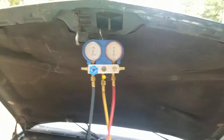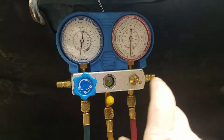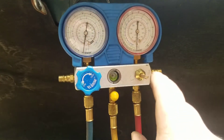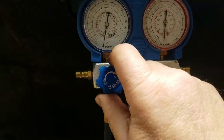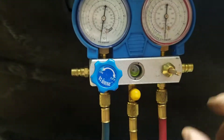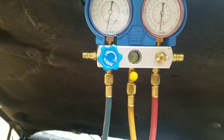We want to keep that from happening, so the right way — or the way I do it, I'm just a backyard mechanic — is to go ahead and shut these two valves right here and disconnect this line from this line, and respectively this line from this line. These do not disconnect you from your gauge, just so you're aware of how they work. They're just O-ring operated so you don't have to turn them hard. Now I've essentially disconnected my pump from my system and my feed line.